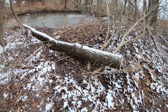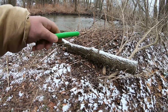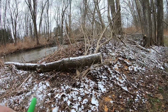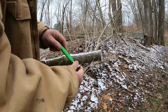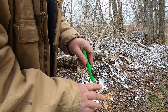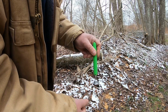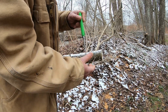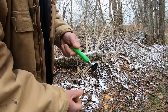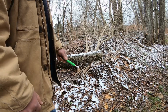So anyways, we'll do some 16-inch marks on there, cut that up, just to show you how well this thing works. Now they're really easy to make. You just get your cut magnet, get your magnetic pickup tool, scuff them down with some sandpaper on each face, use that Gorilla Glue 2-part epoxy, and of course they're magnets so they stick to each other, and you just let it sit for like 24 hours, let that epoxy harden up, and away you go.